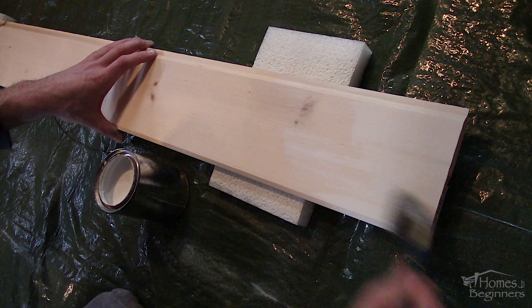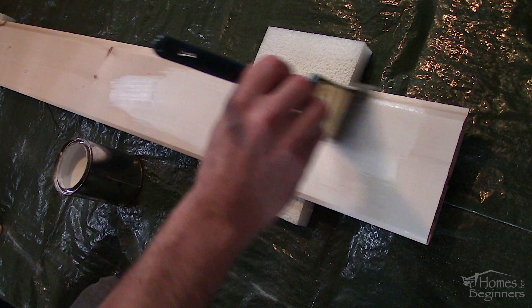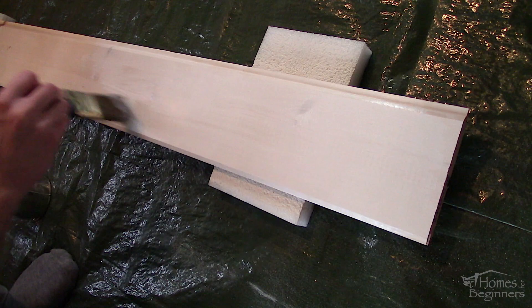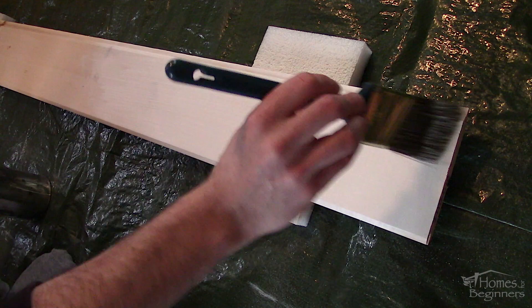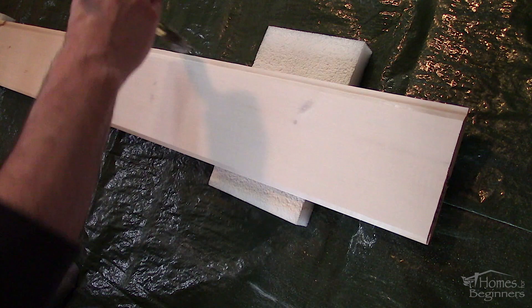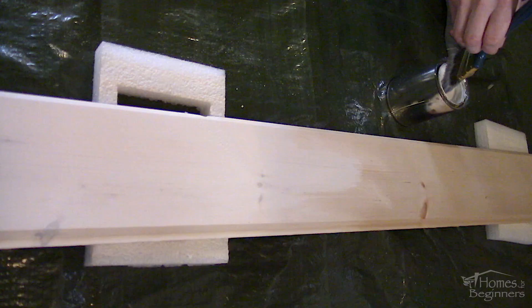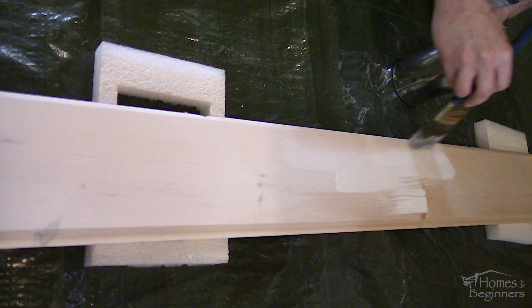Apply the paint. I don't apply too much to the brush so it doesn't excessively soak into the wood and affect the finish. The 1 to 1 mixture still shows the grain quite well and it seems to tone down the knots. At times I do go against the grain on the ends to prevent splattering or drips, however the finished strokes of the brush must be with the grain. I'm trying to keep a fairly dry application. When more paint is applied you'll see the transition on the next application, so you'll need to fade each application. Any knots or imperfections had extra paint applied to allow it to soak in so any cracks will remain invisible.